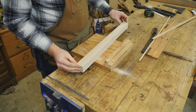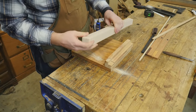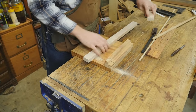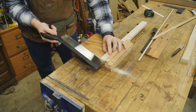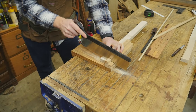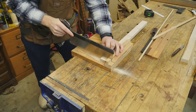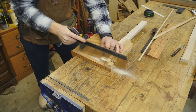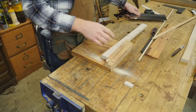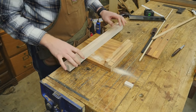I put the pieces together and I was off — apparently I misread something. So what we need to do to clean that up is cut it again. Put an exact mark on there this time. So the same thing again — going to line it up and look at the reflection to make sure it's nice and square. I'm just holding the saw nice and loose — not gripping it, because if you grip it you're going to naturally be twisting the saw. Just holding it so it could almost fall out of your hand. One of them is about a sixteenth to a thirty-second longer, but I can clean that up later.